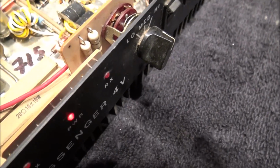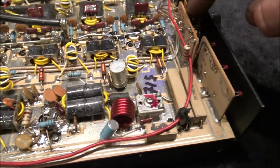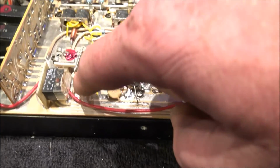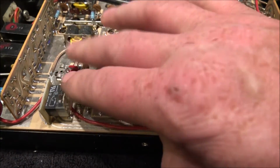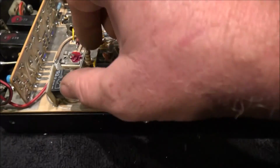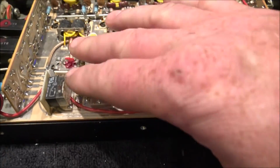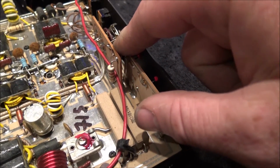These are what knock down your input signal that comes through this little trace. It comes through this trace, goes through this coax, goes through this board, pops out, and it always goes through these two resistors to make the input tune at 50 ohms. These also act as attenuators. Not very much. These are more or less for impedance balancing, but these are your actual attenuators.